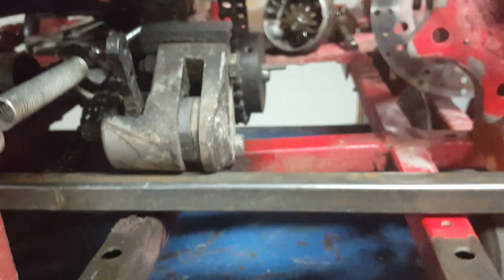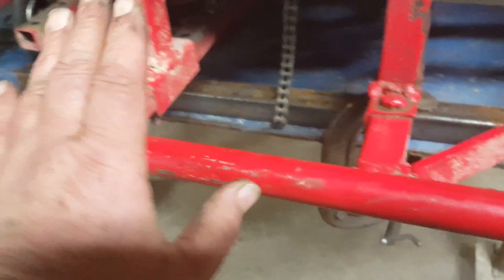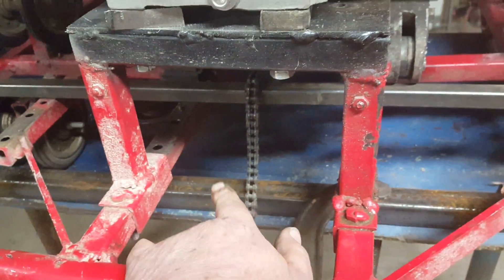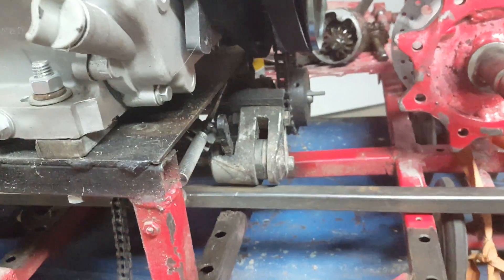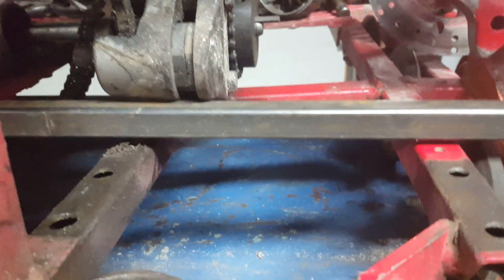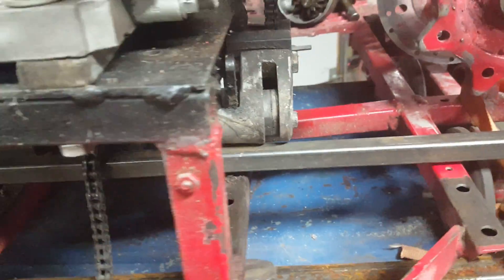I just believe it's because there was a lot of weight, and this wasn't even supported originally — the diagonals were afterthoughts. There was nothing in the middle here at all supporting it. And just from the banging and tagging stuff together like I do, it absolutely bent the frame and put the stress on that aluminum housing. So I'm going to try to avoid that — I suggest we all avoid that by putting plenty of bracing on the frame.